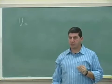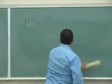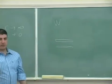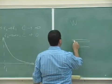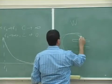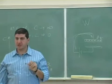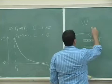Let's think about how much work it takes to store a certain amount of charge on a capacitor. So the work required to store charge — let's say you start out with two parallel plates, and you want to store charge on them, so you're putting a battery and a certain amount of charge DQ is coming onto the plate. The work required to bring that DQ is what we want to find.